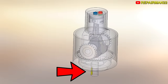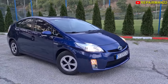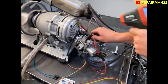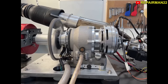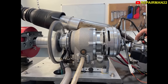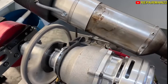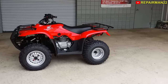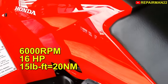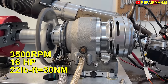The half shaft has a shaft at the bottom where the power output is connected. This engine is intended to be used lying down rather than standing, and thus drive a military drone propeller, being very aerodynamic, or a small generator to extend the range of a hybrid vehicle. In 2021, a real and functional engine was built, and tests were carried out with the dynamometer. Its displacement is 250 cubic centimeters, and it produces 16 horsepower and 22 foot-pounds of torque, all this at only 3,500 revolutions, while a Honda 250 rotates at 6,000 RPM and produces the same power with only 15 foot-pounds of torque. The Avati engine with half the revolutions delivers more torque and the same horsepower, making it a true beast.